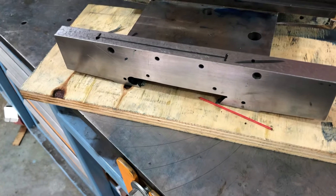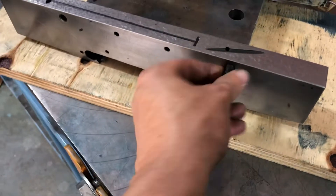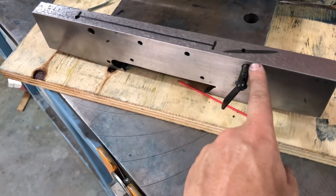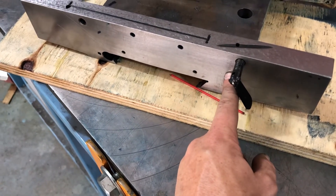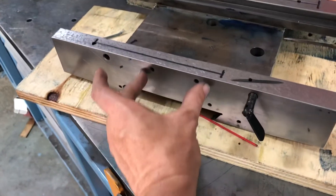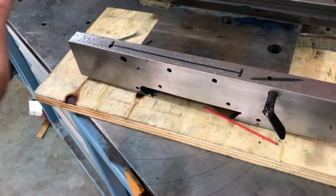I'm hoping that will work okay because we have the locking screws here, and thankfully this does not actually intersect with that locking screw there. So there's enough room in the front here, maybe right around there. The DRO will go on the front of the table there, and I'll probably mount the DRO pickup out here somewhere, and that'll actually also take care of the feed stops.